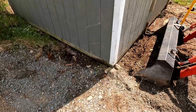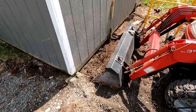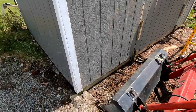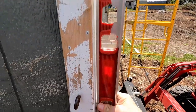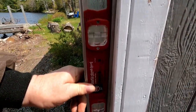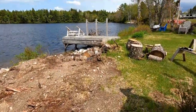I have to tell you a story — get ready. This corner here is up now an inch and a half. The other corner is down as far as it'll go — I've raised it up two and a half, three and a half inches. This middle one here is floating right now. But when I put the level on the wall, it's almost level, but it has to come back towards the tractor — there's an inch at the top. And this one here is level. So this wall is plumb on that corner, on that side anyway.